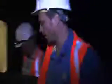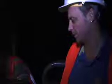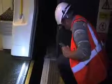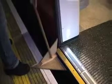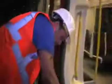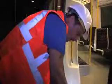What we want to show here is that the doors are now enabled, but when the passenger doors are opened there's no obstruction for passengers either getting on or off the train. So we take a measurement from the opening edge of the door to the tip of the barrier, and we'll record that. I have to take a horizontal and a vertical measurement on the first part of the opening door, in the centre the same, and on the outside of the opening door — and I'll take that on all the doors.